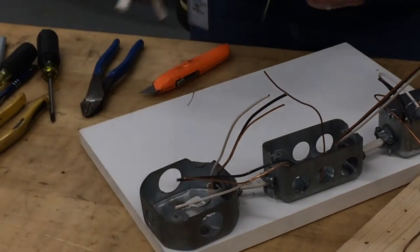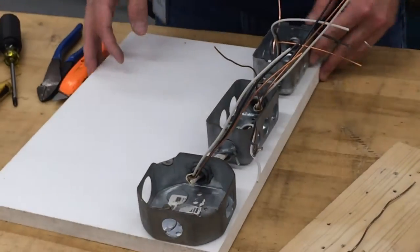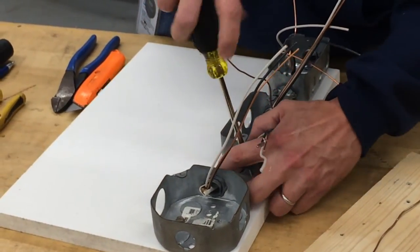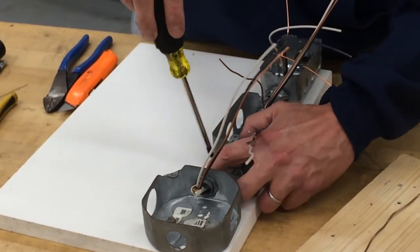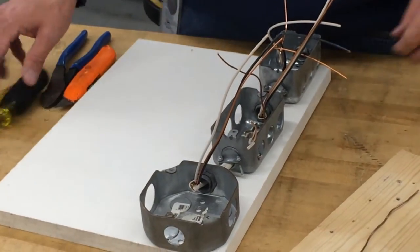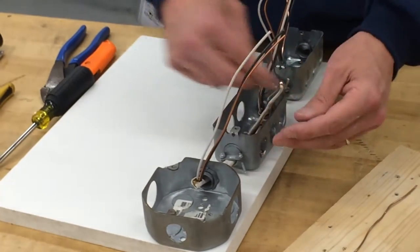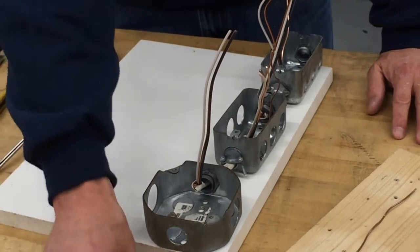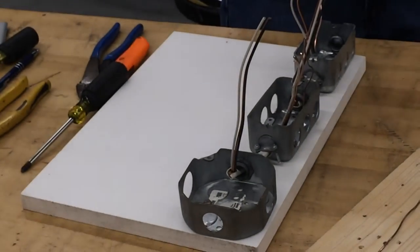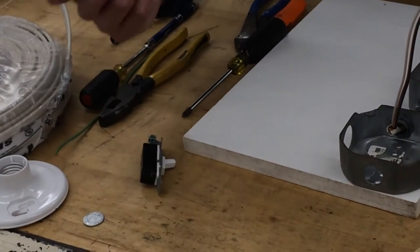Normally, if this were a house, we would wrap all these up, push them back in the box, and wait for an inspector to tell us we could move on. We're not in a house, so you just need me to come by and check that you've got enough wire coming out, that your Romex connectors are tight, and that you've got your ground. Then I'll give you a single pole, single throw switch — don't confuse it with the three-way switch, that's for the next project — and you need an outlet, 120-volt 15-amp outlet.